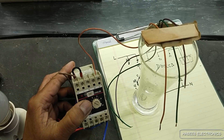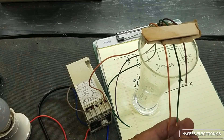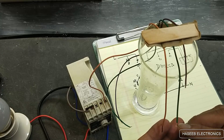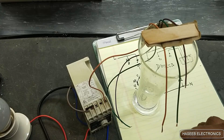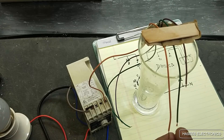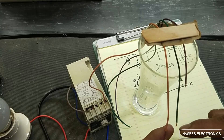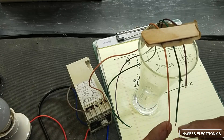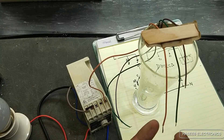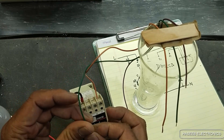Z1 is the extreme bottom level, and after that we have a reserve space. This is the minimum level where the pump will start pumping, so there must be a slight distance — one or two inches — as reserve water level. If there is no electricity the water tank must have some reserve water. This is the startup point connected to Z3.